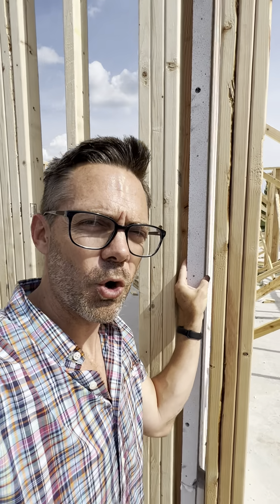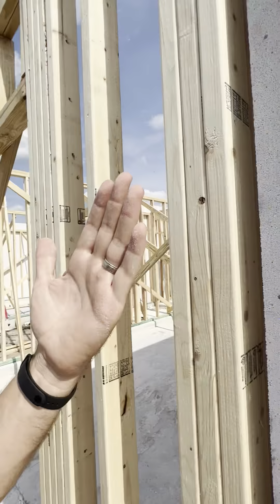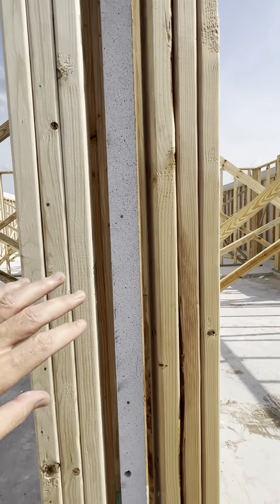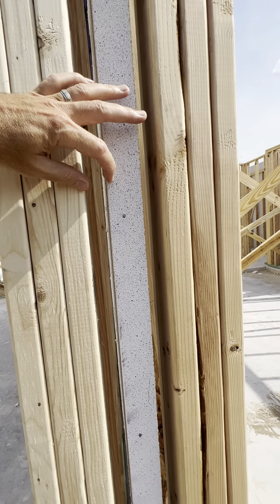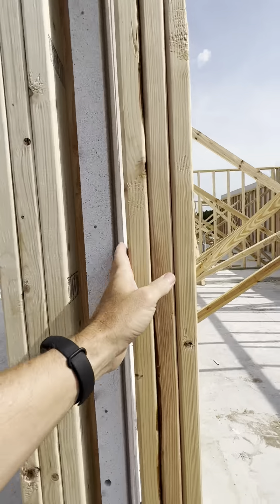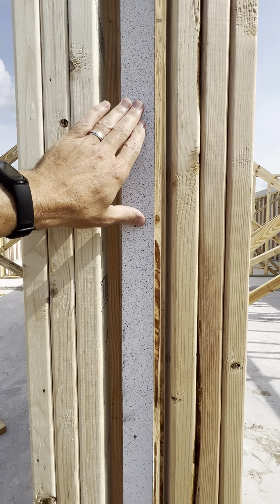If you've ever felt coral reef, this feels like concrete, and it has the texture of coral reef — very porous and kind of sharp. This has got a fire rating; I don't know what it is, probably a couple-hour fire rating. But another key thing to see is that there's about an inch to two inch gap. It's an air barrier — a gap that helps cut down on noise vibrating between the units. So: air barrier, fire rated wall.